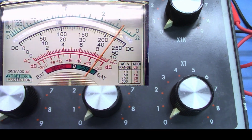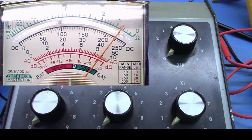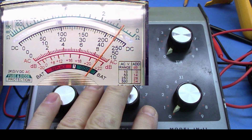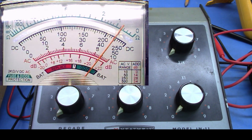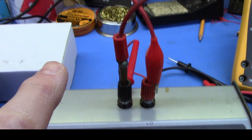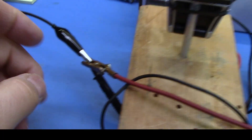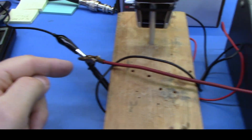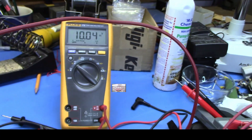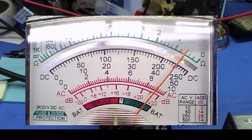And we haven't quite got a 10 volt indication on our meter — it says 9 volts. This one appears to be a genuine voltmeter, because we're applying 10 volts through our resistor, which is now set to 0 ohms, and the meter is only reading 9 volts. So it makes me wonder what the actual applied voltage to the meter is. I've connected up my voltmeter — one connection to our meter here, and the other connection here. My DVM tells me I have 10.04 volts, and yet our little meter down here is telling me we have something just a little bit more than 9 volts.